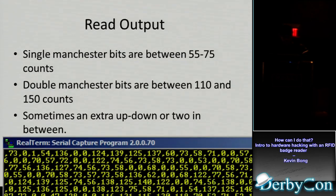And what I got out of that was this count you see on the bottom. So it counted 73 loops, then the state changed, 0 loops, the state changed, 1 loop, the state changed. Those zeros and ones, I don't know if you noticed when we stretched out that signal, there was a little bit of 125 kilohertz in between the next signal. So I just ignore that. I'm really looking for the long ones that are like 70 or 120.